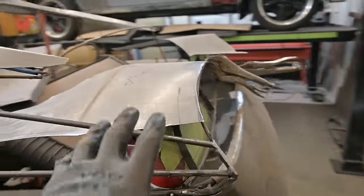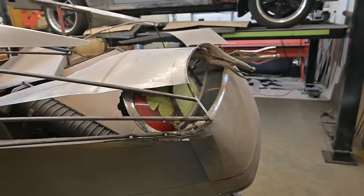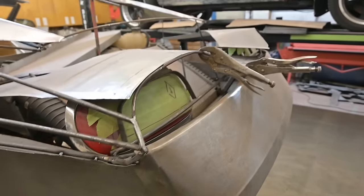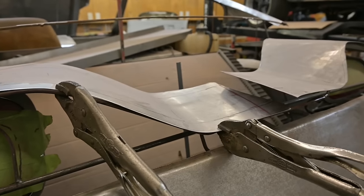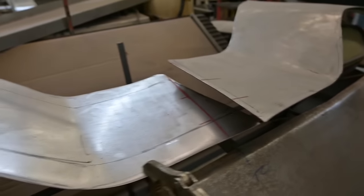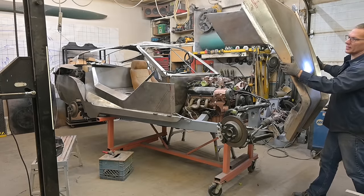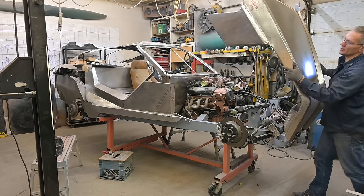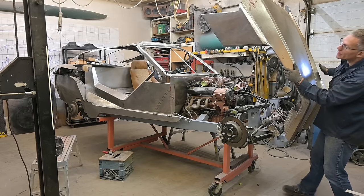I think one more thing I'd like to do today, before we wrap things up, is to start the process of tipping the flanges. See that black line right there? Start the process of tipping that over into the channel area for the LED. It's gonna involve some tipping, some shrinking, and some stretching. This top corner has to shrink, and this bottom area will have to stretch as it comes down. Everything's been scribed. You see the marks there, the witness lines. We're gonna close this. Now you see how there is a little bit of wobble from side to side. We're gonna eliminate that after by finishing the structure inside. Now, hopefully I can pass that body side there without scratching the paint. It's not painted.